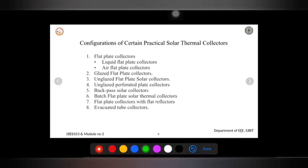It has a reflector and a concentrator, so that we can concentrate the entire energy at a tank surface, which will be black painted once again, or it could be an insulation type where we can avoid the heat losses. Because of the storage tank, the solar absorber acts as a single unit in this case, and there is no need for other components. One more advantage here is we make use of a solar tank and a solar absorber within one unit, so other components will not be required here.